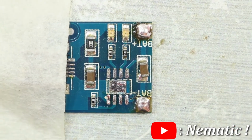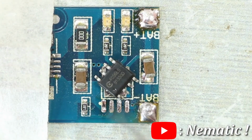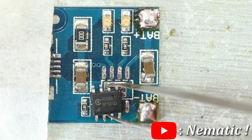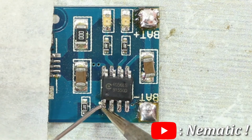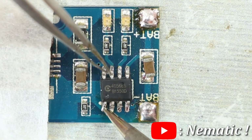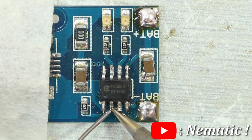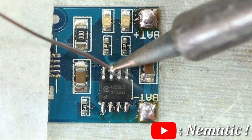Now let's see how to solder ICs. First place the IC on the pad. Then heat the first terminal and apply solder. Once done, solder the diagonally opposite terminal. Then you can solder the rest of the terminals.